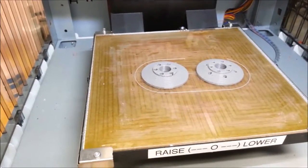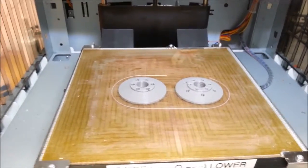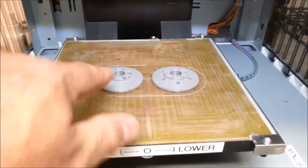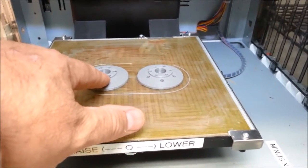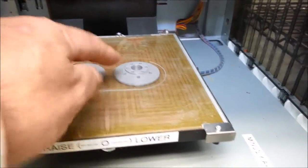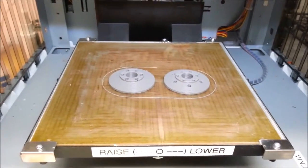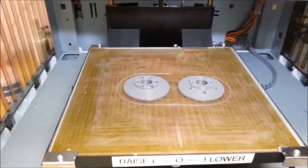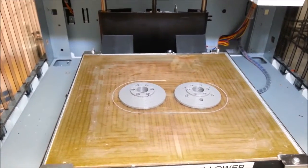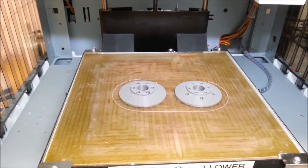Replacement small side pulley for the compound Atlas lathe pulley for Evil Twin X. The problem I had is the shaft hole is very close to the center set of holes that allows us to bolt together this pulley, and the heads of the bolts would interfere with the shaft. So they would need to be ground down in diameter. I decided to move those out a little bit and change the fasteners to number eights, 8-32s instead of 10-24s.